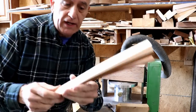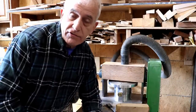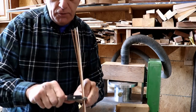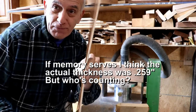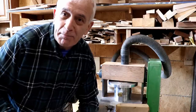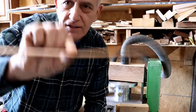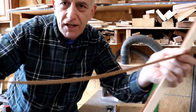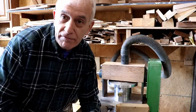It took me close to an hour to sand all these strips down. There are 12 strips, and each strip is 22 thousandths of an inch — that's about half a millimeter for my metric friends. If I measure them all together, 12 strips measures a quarter of an inch thick. I ran them all through my sander without a backer board — try that on your own sander and send me an email telling me how much fun that was. Each piece is so thin it just bends like a piece of paper, and you can basically twist it into a knot. But now we're going to turn this scrap wood into something very valuable.